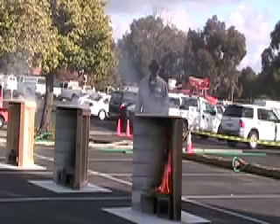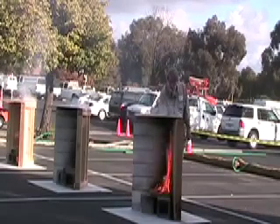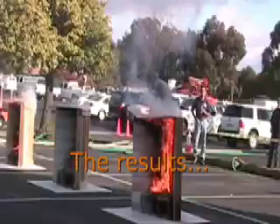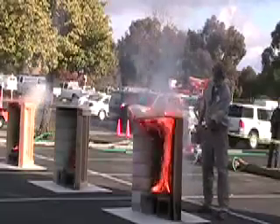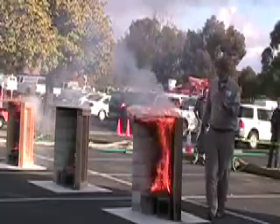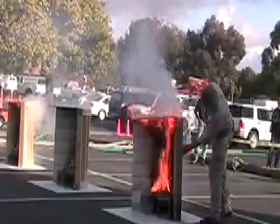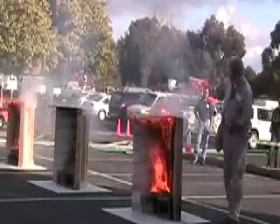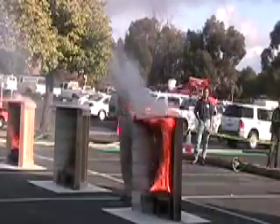We've been doing this for just a few minutes and already there's charring at the back of one of these more simple lap joints. We've burned through now the lap joints with this product, but not on the more complicated joint side. So with combustible siding, the thing you want is a complicated lap joint to prevent flame penetration into what would be the building cavity, and you want something that will resist flame spread.